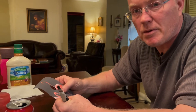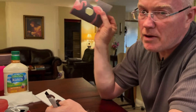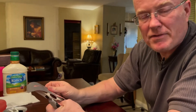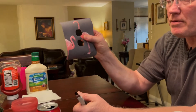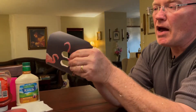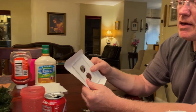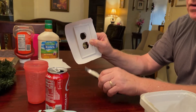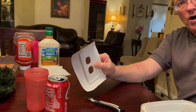That isn't a big deal if you're dealing with light-colored switch plate covers and light-colored wallpaper. But in this case, you have to be perfect. Again, you put the wallpaper against the front of the switch plate cover, and then you turn it around and you cut the holes out with the blade on an angle.